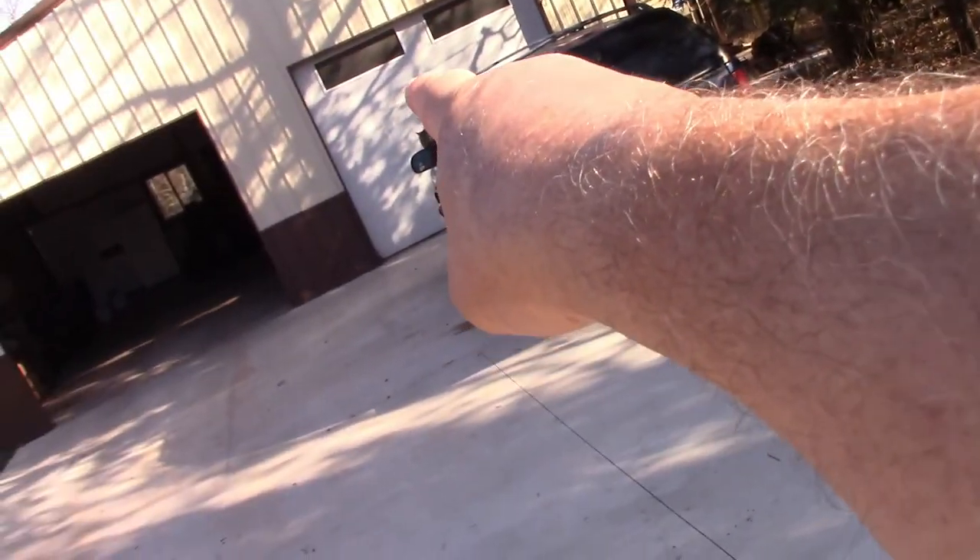Now anywhere you've got cracks — but these here, those are not cracks, those are cuts made for expansion of concrete. If it's going to break anywhere, that's where it'll go. That's what I did when I poured the concrete driveway — I did all my expansion cuts. You can see all my cuts in the driveway. I did all these cuts with a circular saw — I just put a concrete bit on it. They're full of sand but go down about half an inch to an inch deep. The driveway is six inches thick.